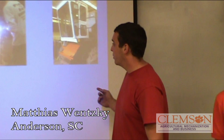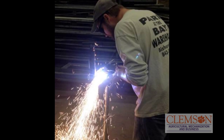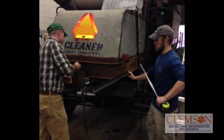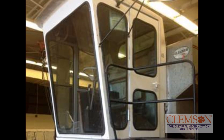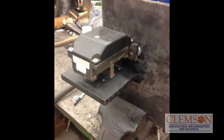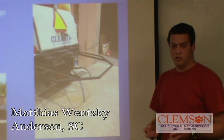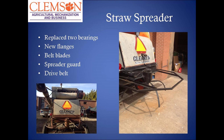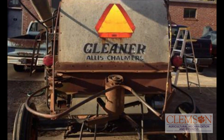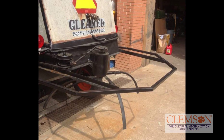These are some of the pictures from when they were building and retrofitting everything. They had to cut off the old spreader guard at the back, and also the spreader. Here's the cab after they sanded it down and painted it. When we were working on the impact plate, this is one of the pictures of that. For the straw spreader, we had to replace two of the bearings inside and put new flanges in as well. The spreader guard had to be replaced because the old one was rusted and falling apart, and we also put new spreader arms on it.